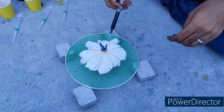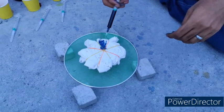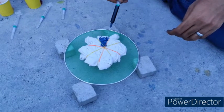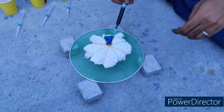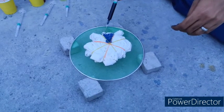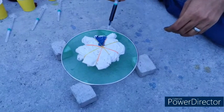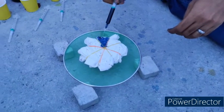Step three: injection garment dyeing using a medical syringe. I have planned to do injection garment dyeing at an MLR of 1:1 — meaning the 80-gram garment will be dyed using 80 ml of dye liquor. Since I have planned to apply four colors, I have taken 20 ml of each shade from the one percent standard solution.